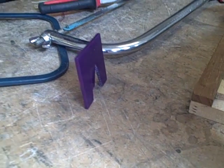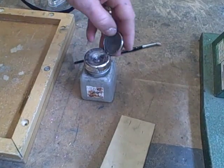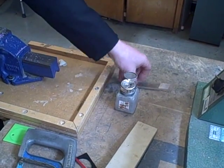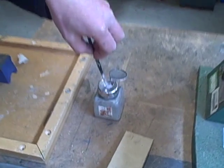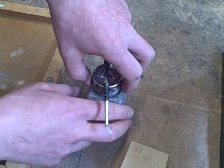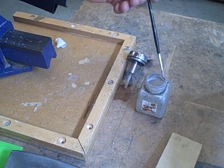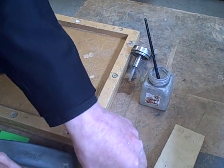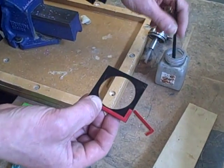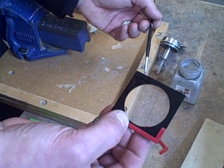The last stage is for us to be gluing up. When we're gluing plastics we tend to use this, which is called acrylic cement. It's in this little dispenser bottle and it's vital that we use goggles with this — it's a very volatile liquid, meaning it can be splashed very easily. You should be able to get some glue out by depressing the top; if that doesn't work because the pot isn't quite full enough, ask your teacher to take the lid off. You're going to use a brush to transfer the glue. This glue works on capillary action, so you don't need to paste it onto two surfaces — simply hold the pieces together, touch your brush up against that joint, and it will flood very happily between those two surfaces.